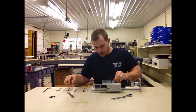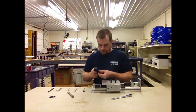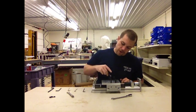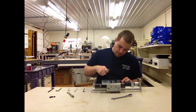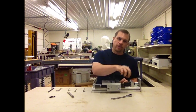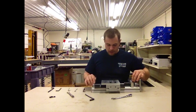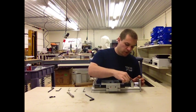You're going to want to line up the carriages so that the two tap holes are aligned with the slots, and then put the screws down in here. After we do that, take your 5/16 inch Allen wrench — a big one — and start to work these screws down. If the screws are tight, you may have to work them in diagonals. I highly recommend Loctite for these nuts. The last part is to tighten down the low profile bearing block and the regular bearing block — you're going to want a ½ inch wrench for that.